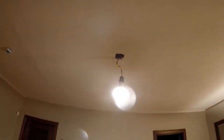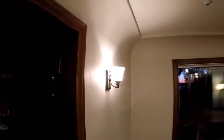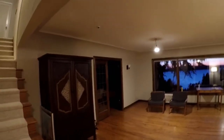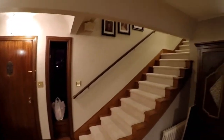The other wire got the old knob and tube sheath. Looking up at the ceiling, those are the old knob and tube lights we discovered up there and reactivated - operated off of this switch here. Those are the two sconces that had also been buried in the mortar. We relocated them to 70 inches high and 19 inches to either side of the doorway opening. This light switch here is the one that operates the sconces.